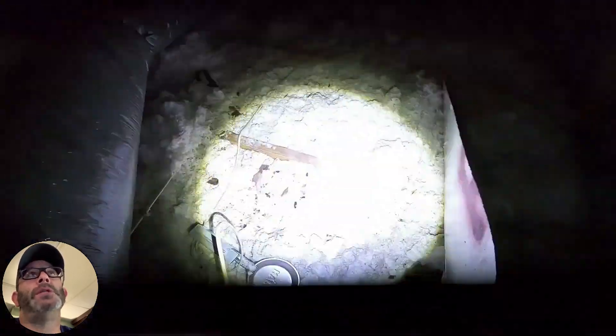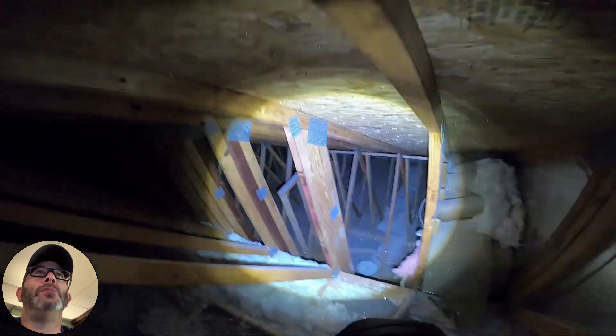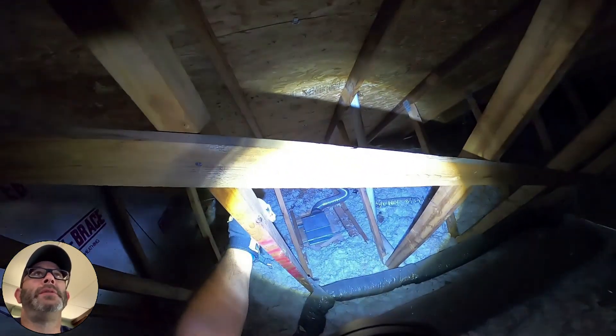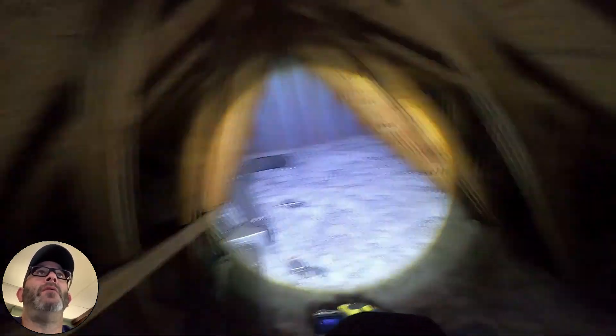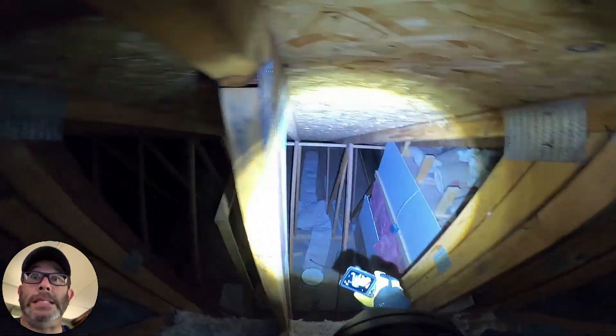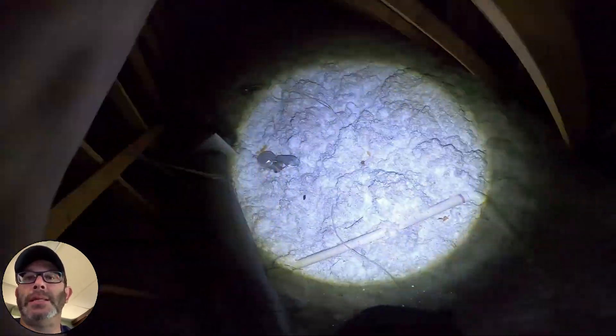Now I wanted to get over top of the bedroom there at the very back — this is over top of the closet for the prayer room. It's more of the same in terms of insulation, but I do think that prayer room closet was added later, which you already know. You can get a good bird's eye view of that closet. It looks a little messy, and the key here is that whenever we have insulation in any place in the house, we also want to make sure that we seal it. So we want to take all that insulation down, get behind it, seal that wall, put the insulation back, and then wrap it tight with some type of sheathing so that the insulation stays in place and is nice and tight in that area.